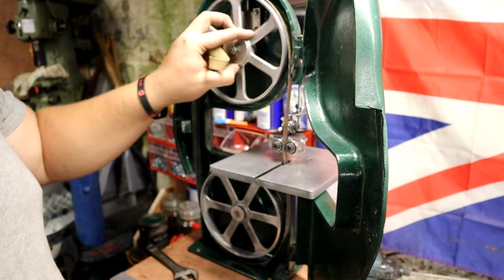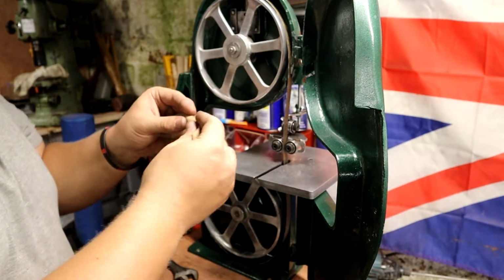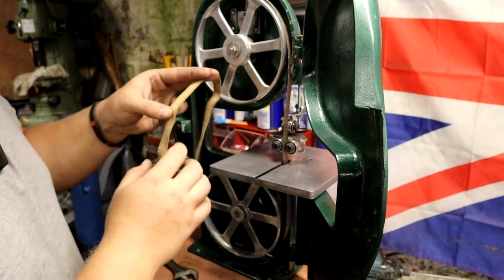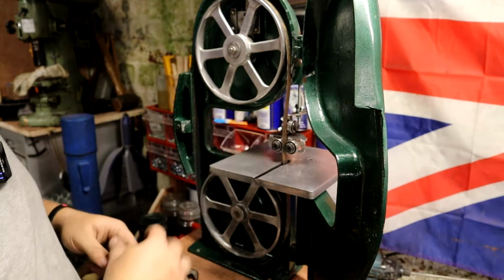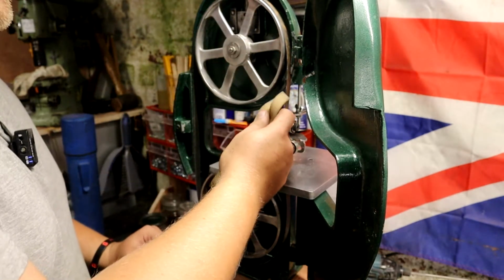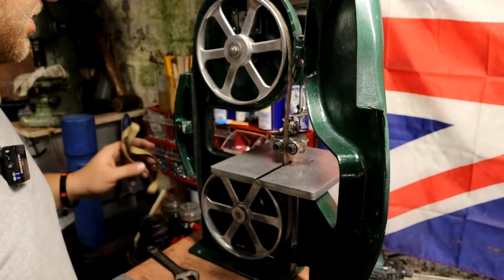If this was a quarter inch bandsaw band, then we probably would be okay, because we'd be nesting the gullets and the center of the blade on the middle point of the band. But we're not, we're using this metal cutting blade, and this is what I want to use for the type of stuff that I'm going to be doing on this. So let's try the tires. Let's try that.